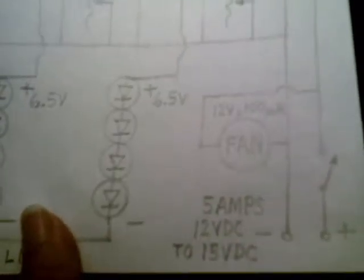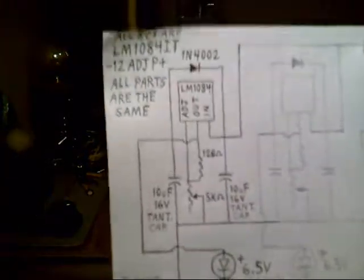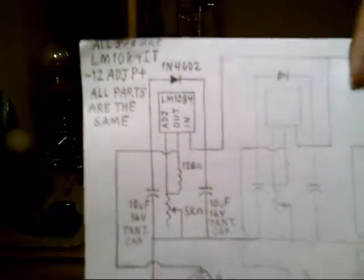There's like five of them hooked together, and it goes down. There's also a fan — the 12-volt fan is like 100 milliamps. And then you've got that end piece, which has a handle, like five amps, 12-volt. The thing about that circuit is that you can run it in a vehicle whether it's turned on or off — it doesn't affect the circuit whether the battery's being charged by the alternator or not.